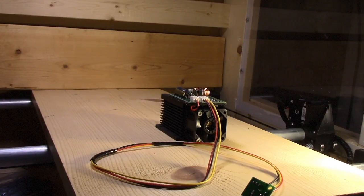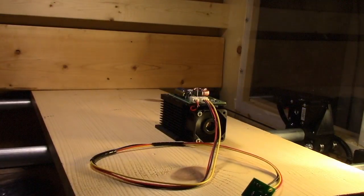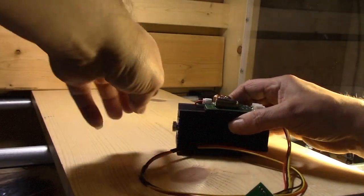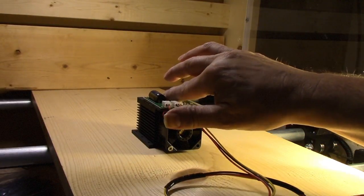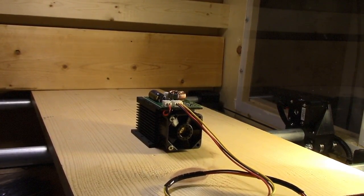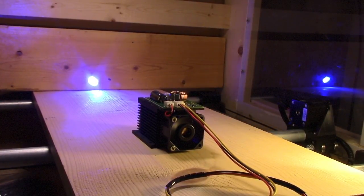Here goes nothing — and hey, we got a laser light! It's way out of focus, but I can smell wood burning — whoa! Yes siree, I can smell wood burning already and it's way out of focus. I was hoping to get it so far out of focus that maybe we couldn't burn anything, but it's not even warm to the touch right now. The power transistors or regulators are not even warm. So it's not dead on arrival — the question is how long it will last. The fan is going at a good clip and pushing air.